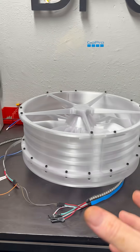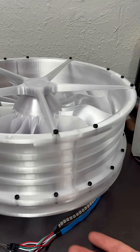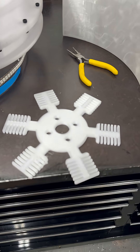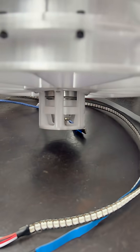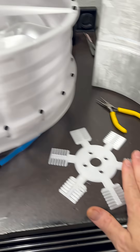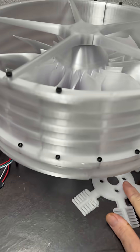We'll get everything over on the bucket over there so I can strap it down and do the motor mounts. I've got to pull the motor mount off and mount the 7070 on it. There's another part being metal 3D printed — those right there — and that's the heat sink between the top of the outrunner and the PETG mount, so the heat doesn't transfer from the motor to the screws and start melting it. It basically dissipates the heat, sitting between the mount and the motor, and that aluminum will be right in the airflow to cool that outrunner off as we go.